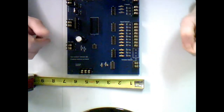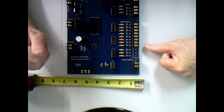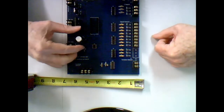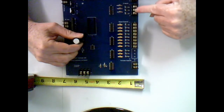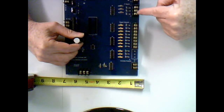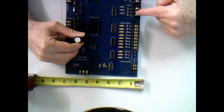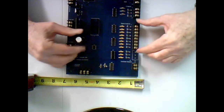Okay. These outputs are meant to go to your signals on like the entrance of a passing siding, and this would provide enough outputs for full signal control of that output of that siding. The inputs give you the feedback that tells you either the switch is closed or thrown, and the switch is, since it's an on station, it has block detection for it, so that the dispatcher knows that there's an actual train in that block and that he can't throw that switch.